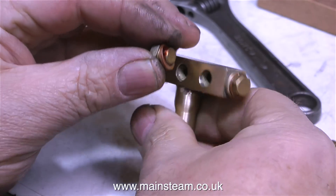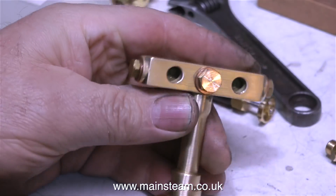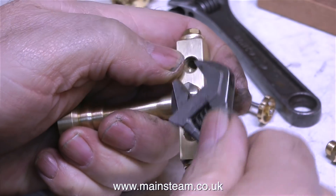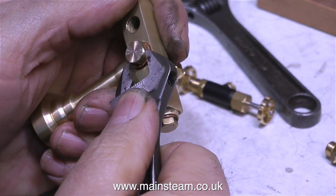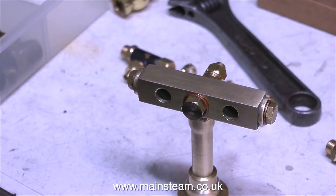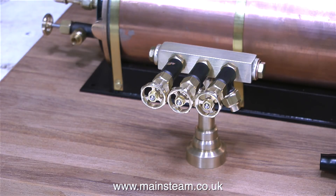In this clip, I'm fitting a brass blanking plug into the centre hole of the manifold on the turret. Why? Because I don't need three steam taps on the turret — they would be too close together anyway. I used 5/8 of an inch spacing between the taps, which is really too close, but I didn't want the steam turret to be a massive big thing. This turret is about the right size and scale for the plant, and it only needs two taps anyway. So that's why I used the blanking plug in the centre.